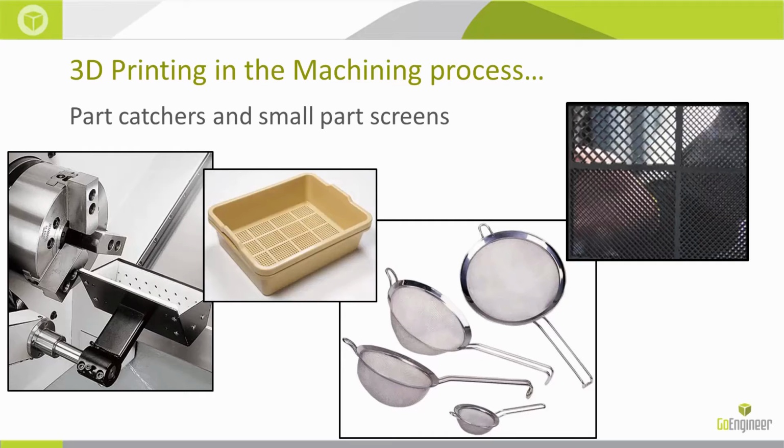Parts catching and filtering, I think, is a great application for FDM, fused deposition modeling. With the FDM process, we have the ability to define the air gap between the rasters, or the zigzag filling structures on the inside of parts. And with Stratasys Insight software, we can remove solid bottom and top layers, so we're left with containers with screen-like bottoms of different shapes and sizes.